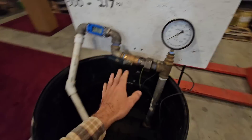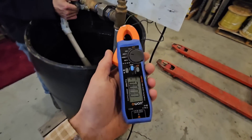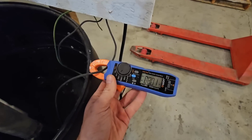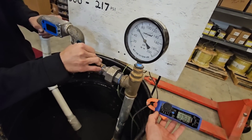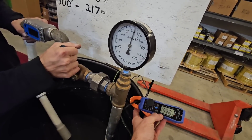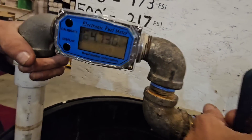So it functions fine. It's starting to vibrate and rattle. If we get our amp meter and clamp that on there, we get perfect fine amps — it's running at 8. Go ahead and close the valve about 80% of the way, give me about 100 PSI. So now we're running 7.9 amps — give me 140. So at 140 PSI, we're at 7.7 amps and we're flowing right at 5 gallons per minute.